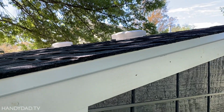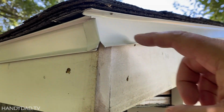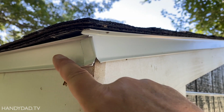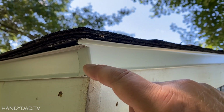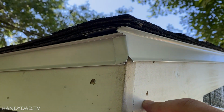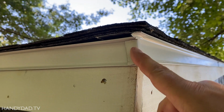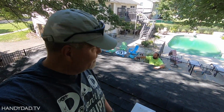And one little detail that I didn't show is actually these corners where the drip edge at the bottom goes on first, but then the sides come on next. And I just cut these, I bent it over so that it wraps around a little bit. Just makes it nicer so when you look at it, you don't see a dark edge where they meet. All right, now that we've corrected the ridge, the roof is absolutely complete, and that's it for this episode. So thanks for watching, and stay tuned for what we're going to do in the next one.